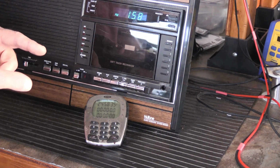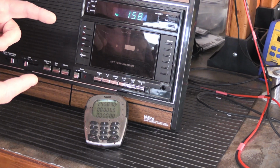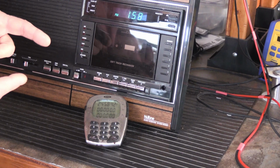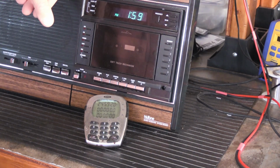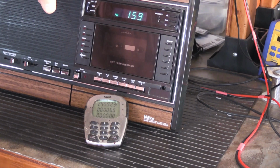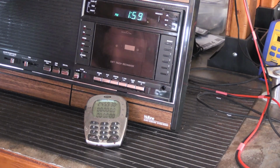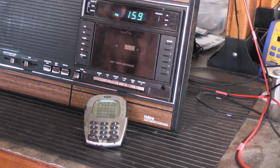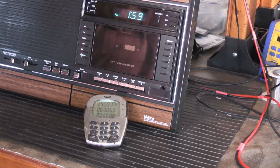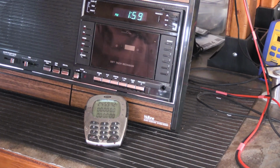There should be no variation other than, I suppose, perhaps the mechanical variations, but they've been making clocks for a long time, so I think they got that worked out. So accuracy between clocks is a thing. How accurate is the clock in an IM4006? I don't know exactly, because there isn't any specification that says what the accuracy should be. So it has to be what seems reasonable and typical. And reasonable and typical seems to be, based on our very small sampling of 3 sets altogether, approximately 3 to 5 seconds a day. Gain, not loss.